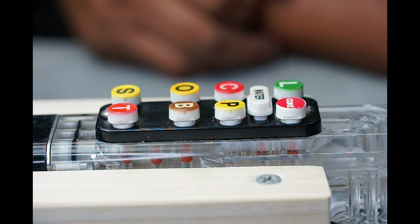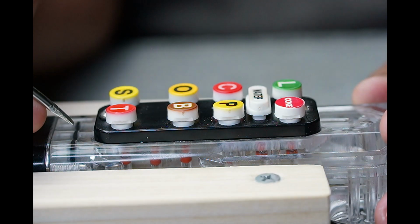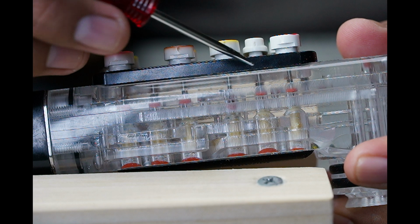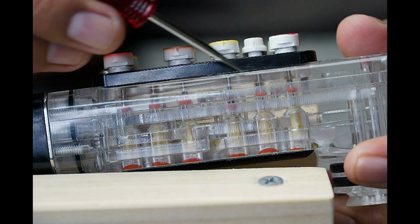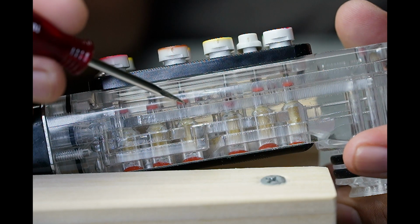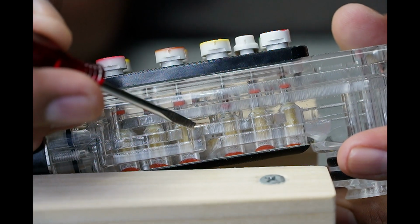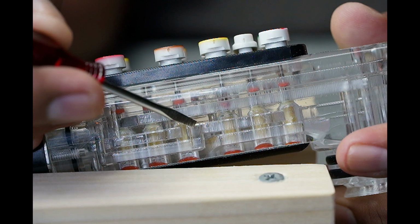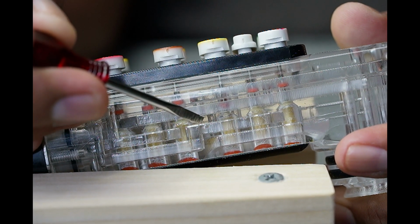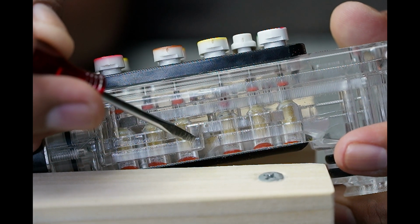Manufactured by Wunderbar, it is the 2.5. It was prior to the M4. This particular gun is an 8-button, actually it's a 9-button gun. They commonly leak on top. This particular top O-ring is what has the tendency to fail. Another issue that's faced is the plunger. It might have some debris or might develop a nick. That's another possibility. Or the actual spring. It's down here. That spring can break.